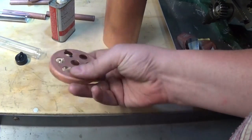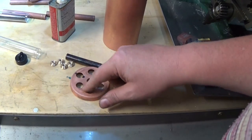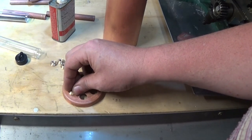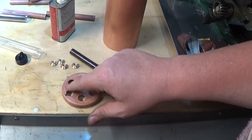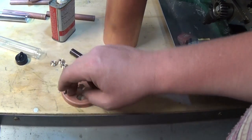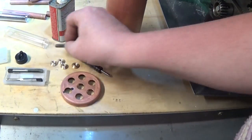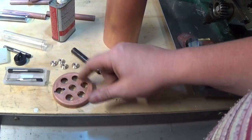I'm going to make a bush out of copper. The piece of phosphor bronze I had isn't big enough because those holes are half inch - 12.7mm - and 14 mil is just a fraction small. I don't like it, so I'm going to go to probably 16 millimeters and tap it 5/16-32, which is quite a solid hole through the middle. That'll work for the blow-down valve because it's less likely to block up, and it'll work for the safety valve because it'll let a bit of steam through.